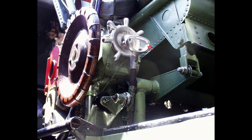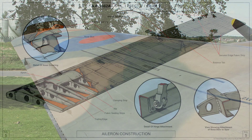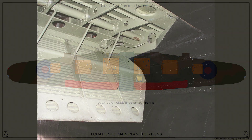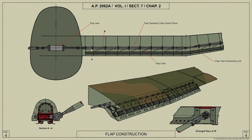The trimming tab is attached to the aileron by a piano type hinge and is adjusted from the pilot's cockpit by means of a hand wheel on the trimming tab control box. On each aileron is fitted a balance tab, constructed and attached to the aileron in a similar manner to the trimming tab; it is operated by a connecting rod between an eye bolt on one of the hinge brackets and a lever on the tab. The split trailing edge type flaps are built up in two sections, the inner flaps being located in the center plane and the outer flaps at the inner end of the outer plane; they are operated by tubes and links, the outer flap tube being connected to the inner tube by a ball joint.